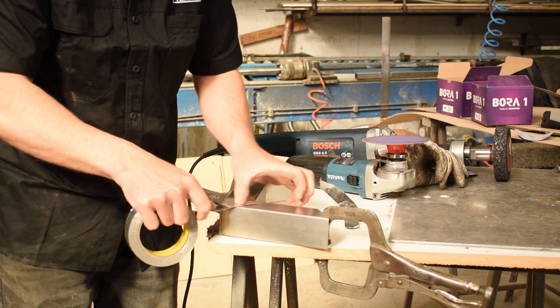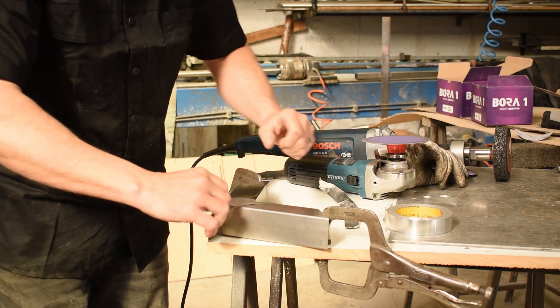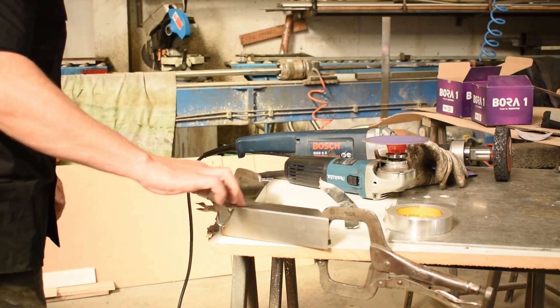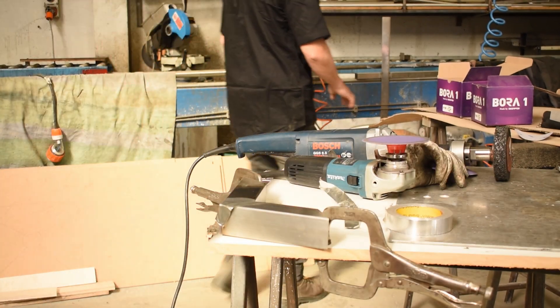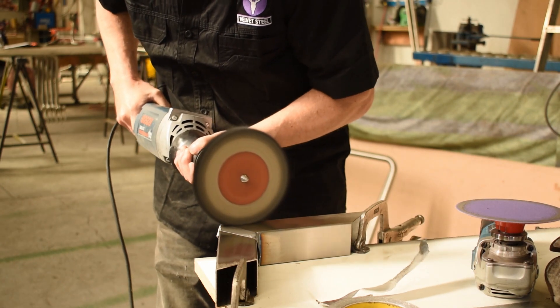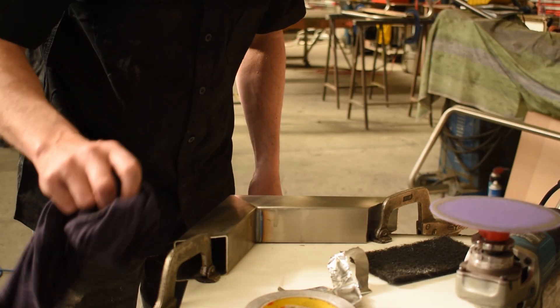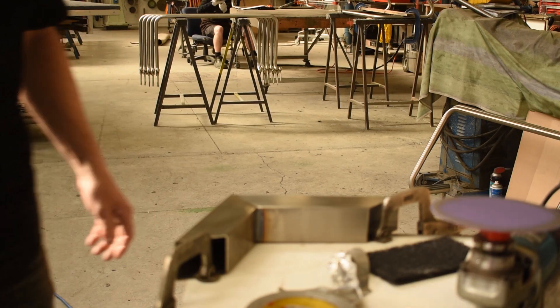It's a lot better in labour here. Once you've used it for a week or two you'll soon see that it's definitely cutting down the labour costs. We go straight from a variable speed grinder through 120s and 180, then to the 240, and then straight to a polishing process. It cuts a lot of time down with changing the discs and everything, so I totally recommend it.